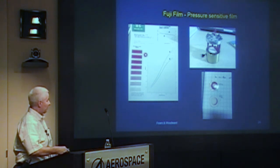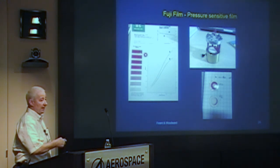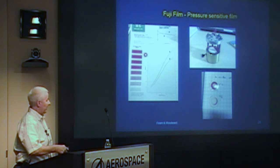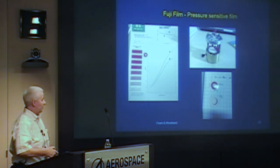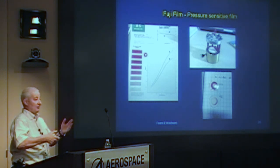So this was looking at here's the actual disc right here. It was right at the top of the range, so we were talking about 7,200 psi around the edge, and in the middle it was way down here, so it was more like 900 psi in the middle and 7,200 around the outside. So I was actually shocked that we hadn't cracked more discs and made a mess of them, or chipped them on the edge or some such.